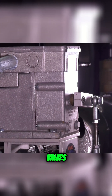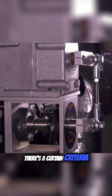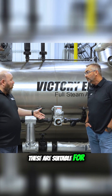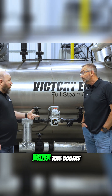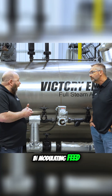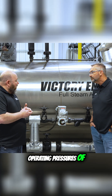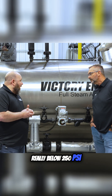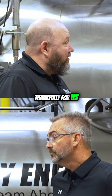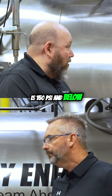When we talk about boiler feed water valves, there's certain criteria you need for sizing these. They are suitable for fire tube or water tube boilers — that's generally where we see the most of them in modulating feed. Operating pressures are really below 250 psi; we don't really want to go over that mark, and most of the market is 150 psi and below.